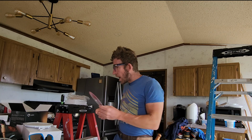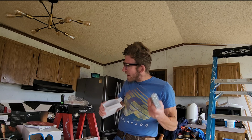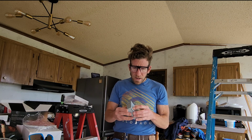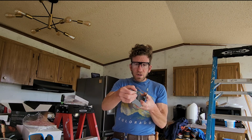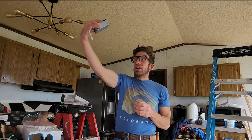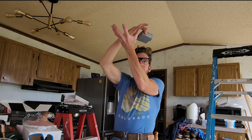Very simple. I did not show you the smart box. A lot of companies make these. They're not very expensive, but I have a lot of Lumeri. Pretty much all the lights in my house are Lumeri, so I do like them. And then you have your box right here, which you do got to put a squeeze connector beside, but I have a video about how to wire this. Not very hard at all. And then this, since it's so light, literally sits on top of my drywall as the light clips in.